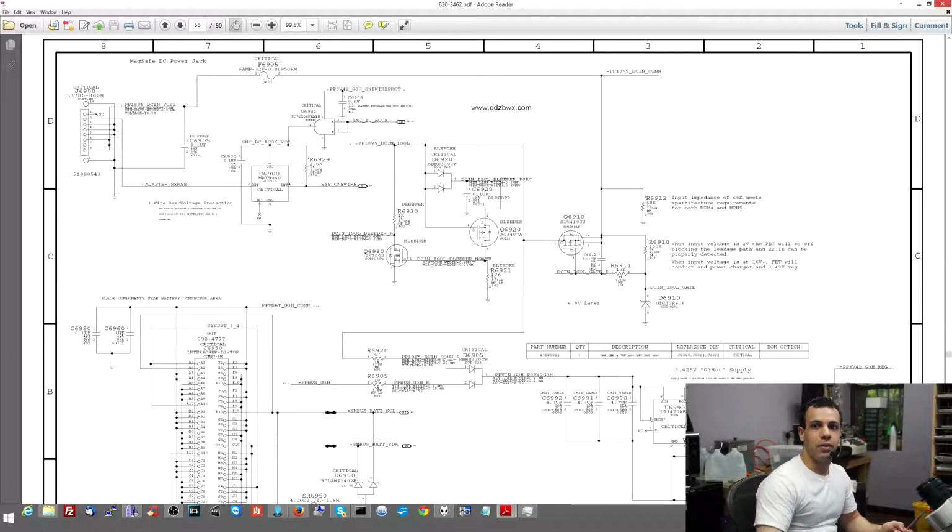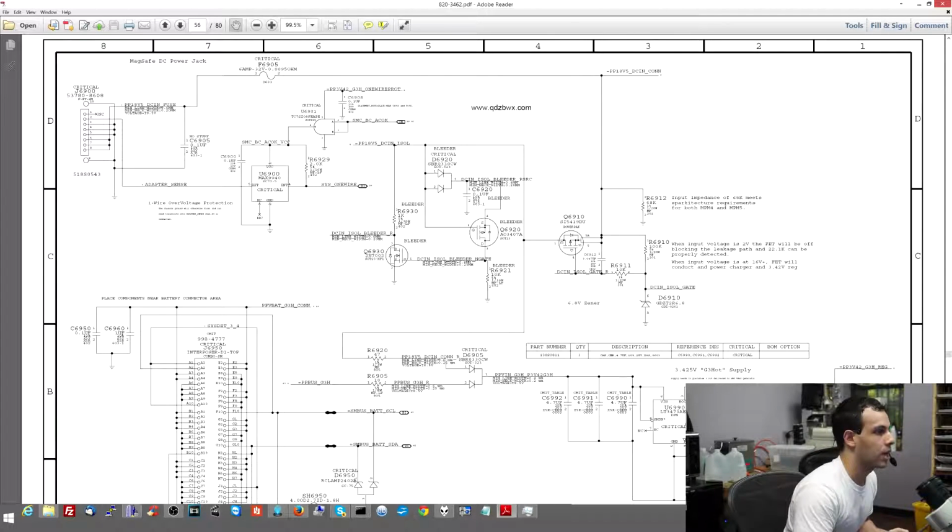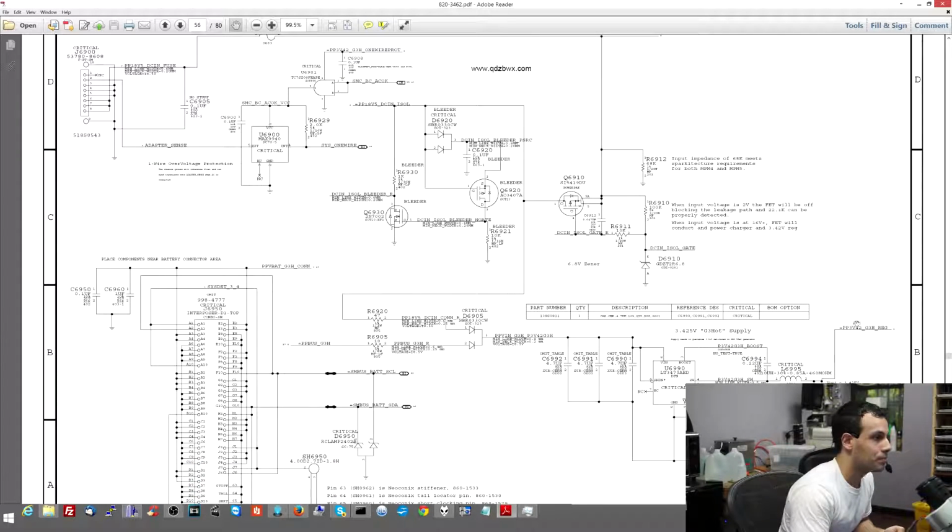When I see PP5V, I assume 5 volts. When I see PP3V3, it's 3.3 volts that's supposed to be there. It's just a good way of figuring out what's supposed to be in different places. So, now when I measure PP3V42_G3H, let's try measuring it on L6995, and let's see what I get.